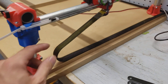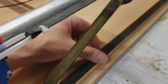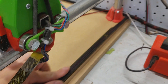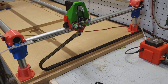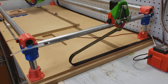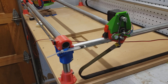For the wire management, I've used a tape measure that I sacrificed, which is run inside wire loom that is screwed down here and over here in order to keep it nice and straight. It keeps the wires tidy as it moves and prevents them from bending too tightly.